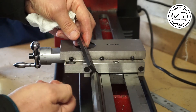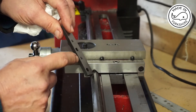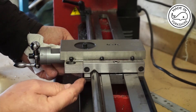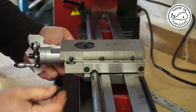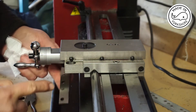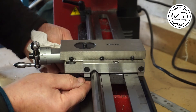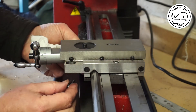So what I've decided to do — and I think it works well — is adjust these little screws so they come out around about 0.8 millimetres. By doing that, it makes the bottom of this parallel with the bottom of the carriage. So then putting the cap head screws underneath, it's just a matter of tightening up against these and allowing for a small amount of clearance underneath the ways. It does seem to work, so I'll just assemble this and see what it looks like.